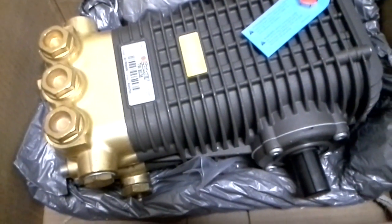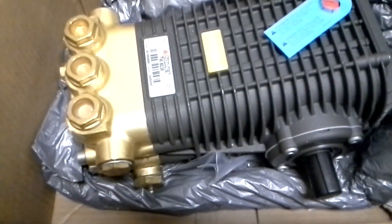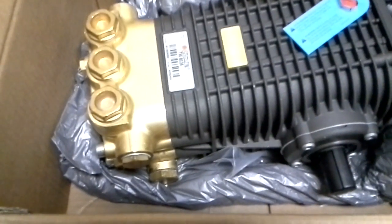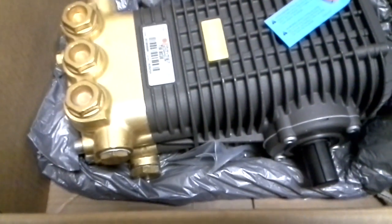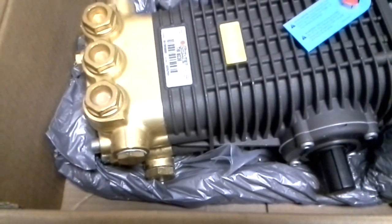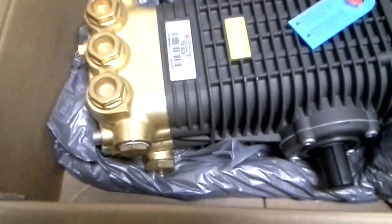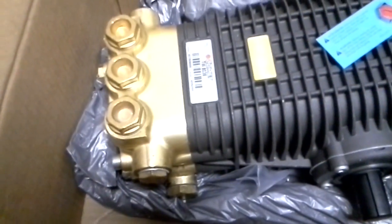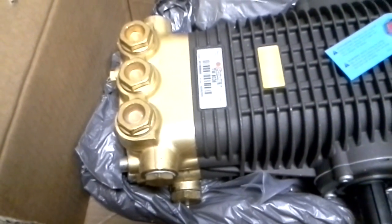This pump should serve me well. It holds around 37 fluid ounces of oil, in comparison to a 22mm general pump which holds around 40.6 ounces. That 22mm bore pump from TSF General Pump at 1,450 RPM would produce around 8.5 GPM.